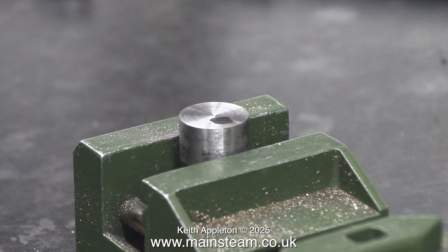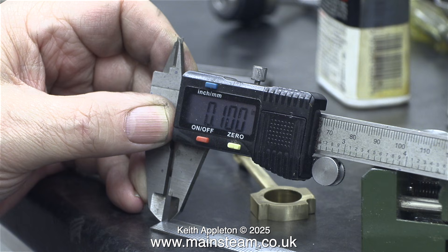It's really important to make sure that any parts you're marking out are well supported so they can't wobble about. I am about to show the non-numerical version of marking out. On the steel rule, the graduations are actually cut into the metal, so they are slots.